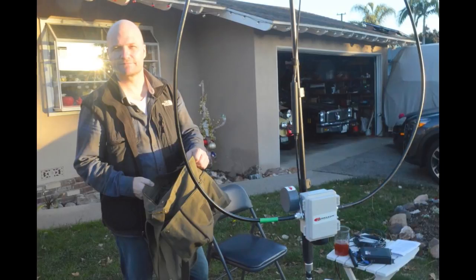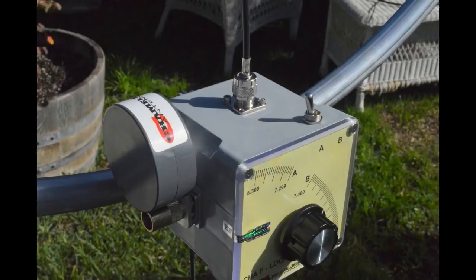Now, this is Carl Lavoie of Chameleon, and I said, Carl, can you set us up? Jim was watching, and in a few minutes or less, bingo, he did. And that's using coaxial cable. I think it's LMR 400 with a solid conductor. So we have good symmetry of that outer loop. And again, the feeder loop is that loop that is on the top.